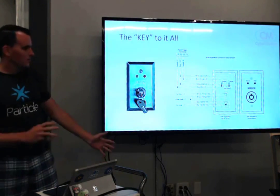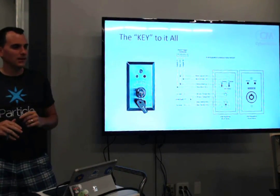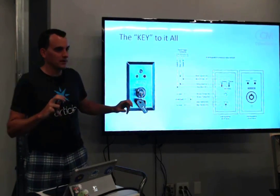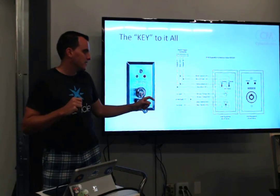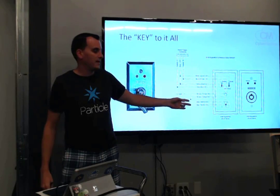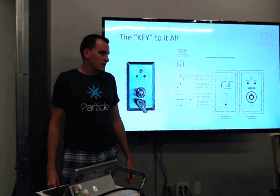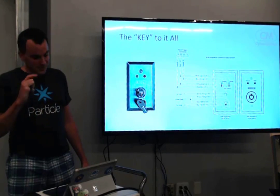That's the end of the home alarm section — we're going to go into the IoT side of things. Any questions on the home alarm? The key switch has a tamper switch as well so they can tell if you open the cover, which is technically two zones on the controller: one for tamper and one for the key. I really just have one zone dedicated to the key switch input, and it's just looking for that momentary connection to either arm or disarm the system.